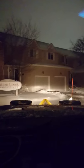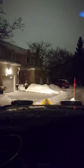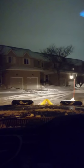So what I'll do is back out here, try to get the whole apron. I'm going to just push straight in, leave a square. Driveways aren't square at the end, they have an apron. Now this place, because of this hard right turn here, I'll come up this apron and drop the snow there. And so I try to turn the corner and drop it there. And then when I come in on the other side, I can just run straight down and I'll pick that snow back up as I go and carry it down. So there's my apron, nice and clean.